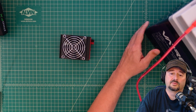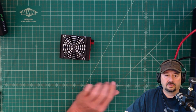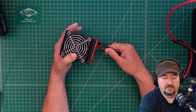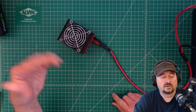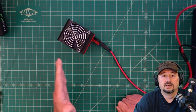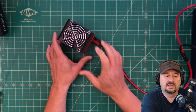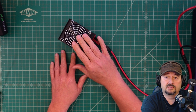For this capacity test we've taken some 10 gauge stranded copper wire and connected it to the positive and negative terminals. We're going to feed this wire into the CBA-4, a computerized battery analyzer from West Mountain Radio. The CBA connects via USB to our computer. We're going to do a drain at 10 amps per hour — that's a 0.1C test, meaning 10% of capacity. We have a 100 amp hour battery, so draining at 10 amps the test should take about 10 hours. I run at 0.1C rather than 0.2C because sometimes the CBA gets a little bit hot.